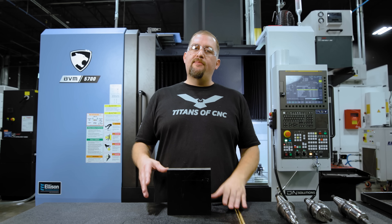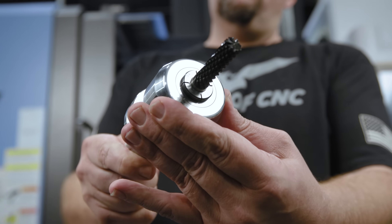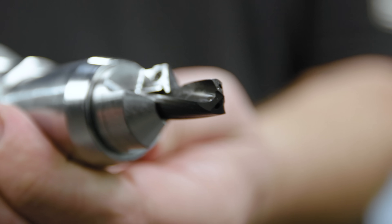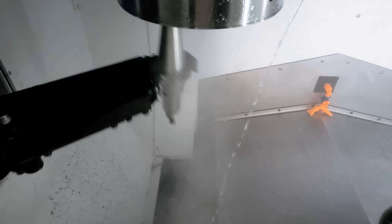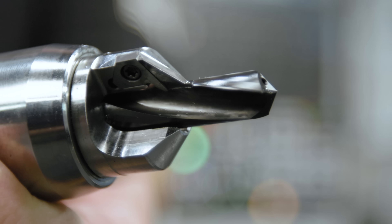In order to be able to machine this stuff efficiently we brought in three secret weapons. The HyPak system consists of a DAL drill bit that's specifically for composites, laminates, carbon fiber reinforced polymers, and metal composite stacks.